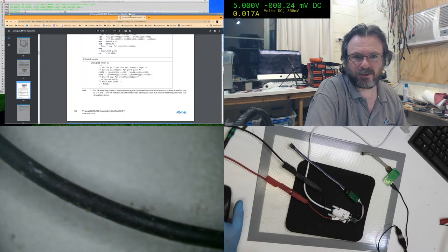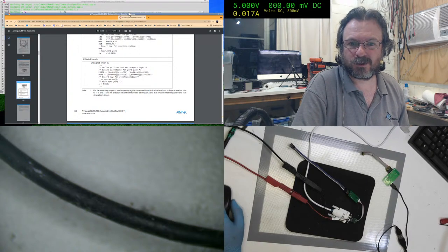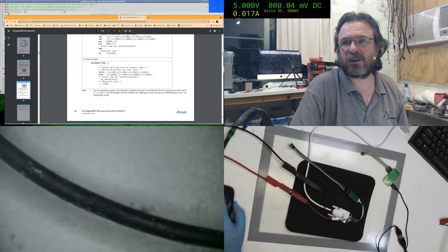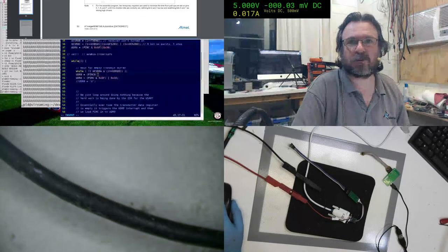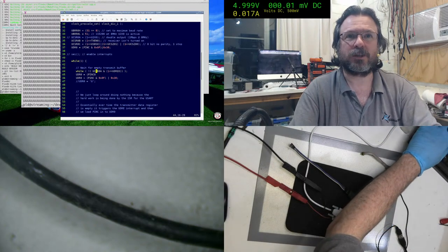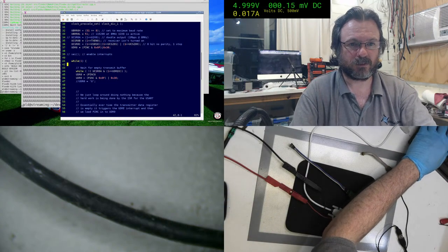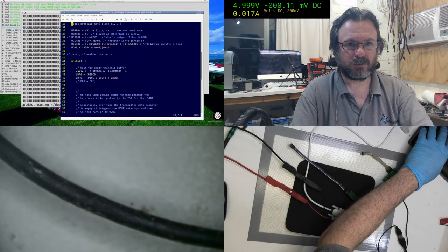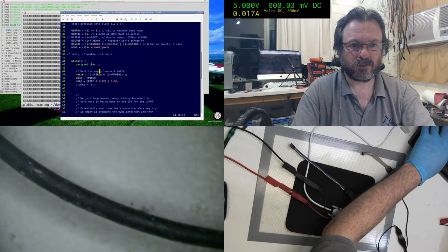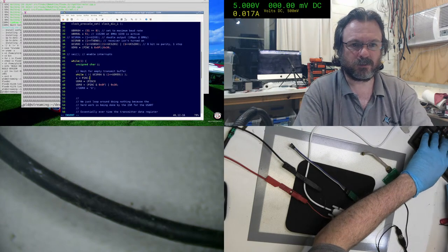example, it says, it's right there, I equals pin B. So I should be able to just go I equals pin C. I'll put in a NOP just in case it needs to be synchronized. Maybe I'll make it a temporary variable. Unsigned char I. Make it a volatile one too. I equals pin C.